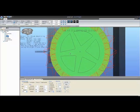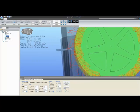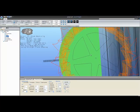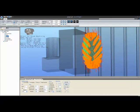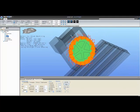what you will see is our teeth, which are not really a true spur gear tooth. They're too fat and just not the correct shape. It isn't until you look at them at the right angle that they begin to look like proper spur gears. So that's a helical gear, and should cut quite nicely. I have tested spurs this morning, but I have not yet tested helicals and so on, but I'm not seeing any errors. We also have herringbone gears.